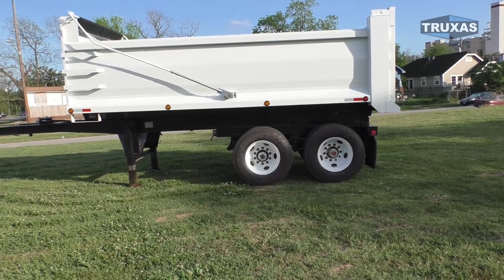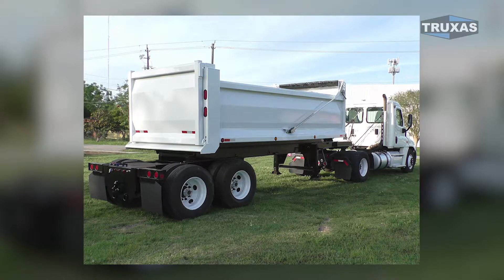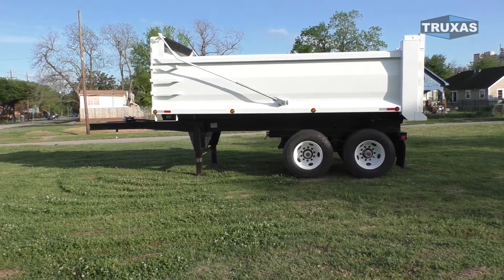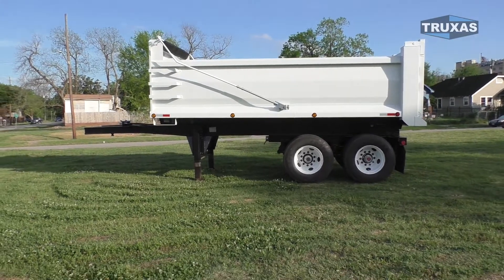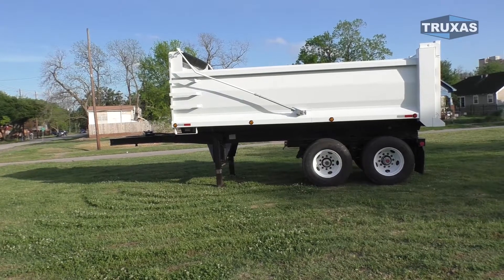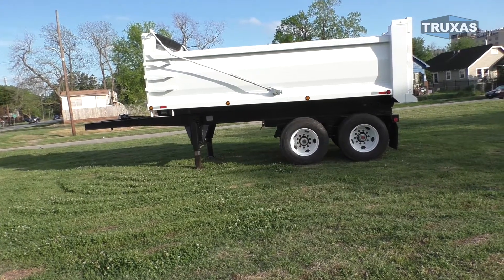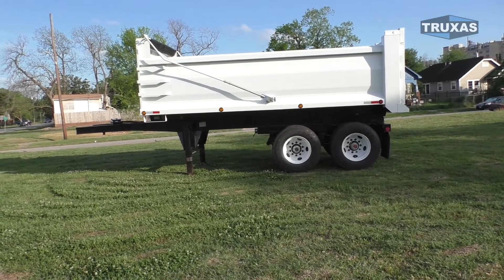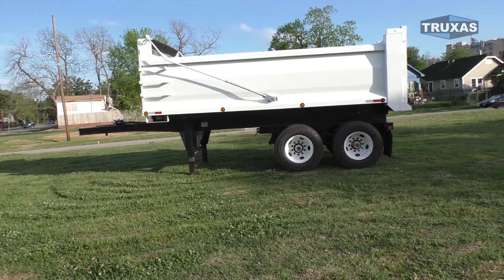You're not having to push the load forward or back, and that would be with the axles slid back when you're driving down the road. A typical single axle tractor with this trailer, you can get 20 tons in there, and in some states 22 tons — so between 20 and 22 tons. The cost is great as well. These trailers are pretty inexpensive and you connect a single axle tractor to them and you've got a 20 to 22-ton hauling setup that's really maneuverable for an excellent price.